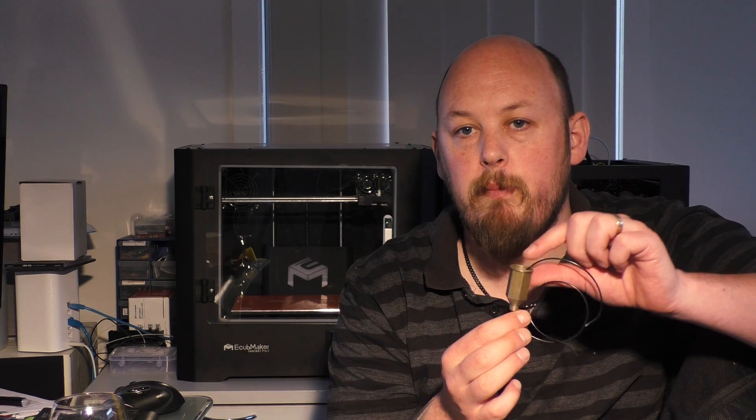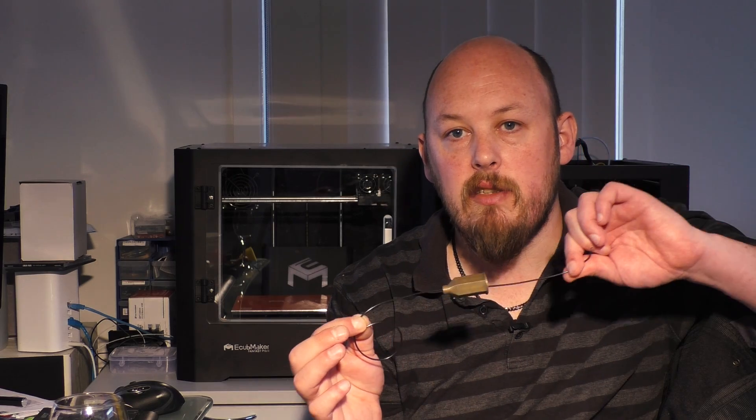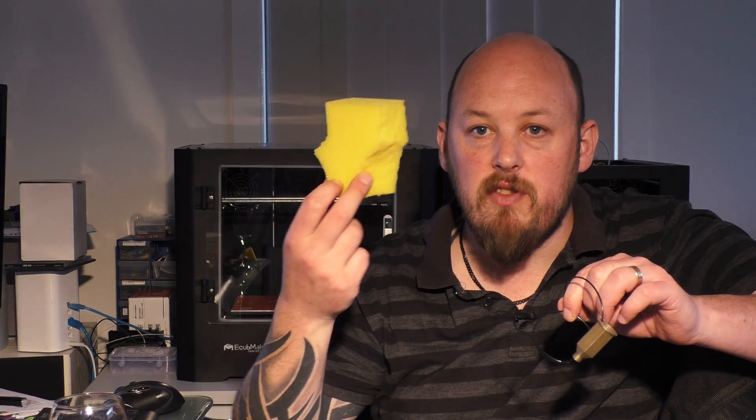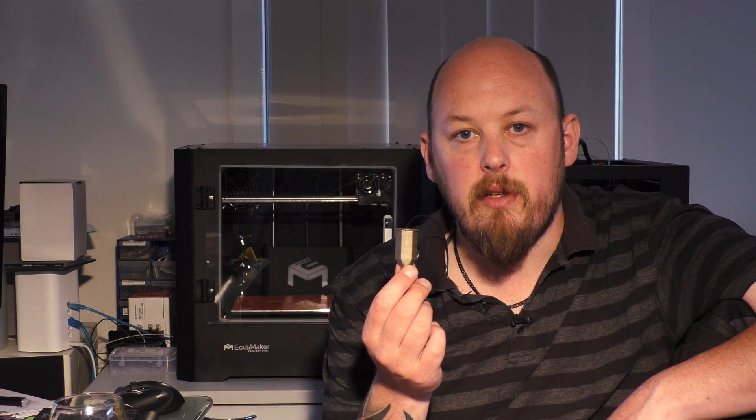It's easy to maintain — just top up a little bit of oil in the top and it just works. Since I've done this I've noticed a fairly dramatic improvement in the consistency of my printing, so I would recommend you just give it a crack. It doesn't cost anything — a couple of cents worth of plastic — and you can use an old bit of sponge, some cotton, or just an old cotton t-shirt rammed in there, and the filament will pass through and get a clean on the way through. Nothing to lose — give it a crack. Thanks guys, catch you on the next one.